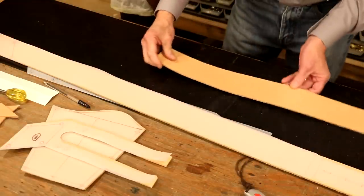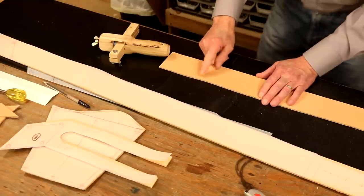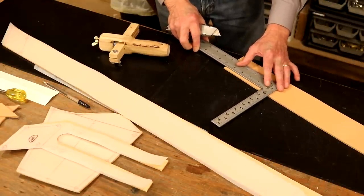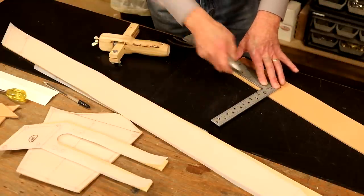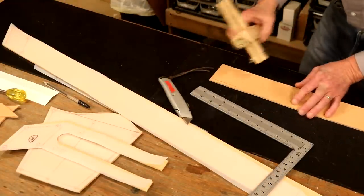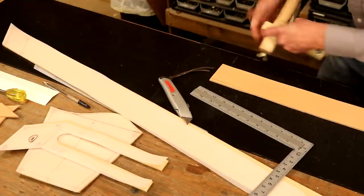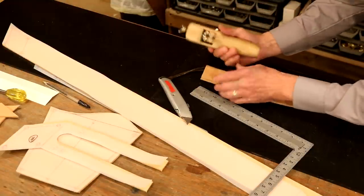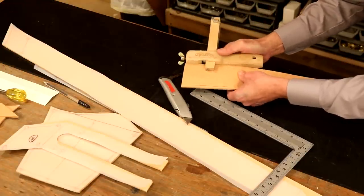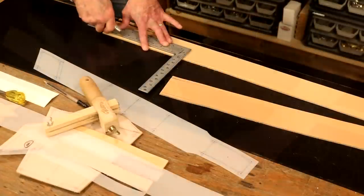Let's cut our taper. There are two ways: we're going with the wooden strap cutter. I'll bring it right down to that point. We can also go with a square — let's cut from that mark out, keeping a quarter-inch parallel cut. On this side, let's use our wooden strap cutter, come down to one-quarter of an inch, and pull that down to our mark. Remember our blade is about three-eighths of an inch in, so we need to go three-eighths past that mark.